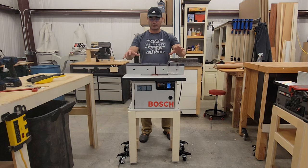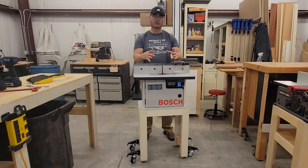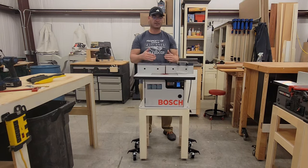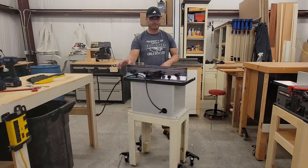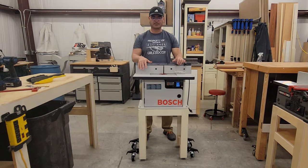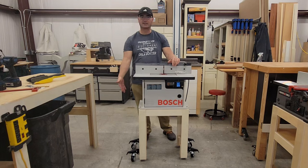The big reason I wanted to move the casters to the outside is that with that smaller wheel footprint, I was afraid I might catch a piece of wood on the floor, or a cord, and the last thing I want is a piece of equipment to topple over just because we didn't safely configure the movement mechanism. It's real simple movement now. Remember — when the footprint gets really small, moving the casters to the outside is probably the better option, even though my preference is inside because of the tripping hazard on the outside.